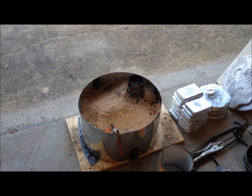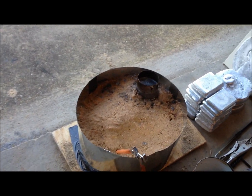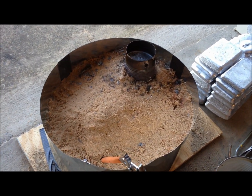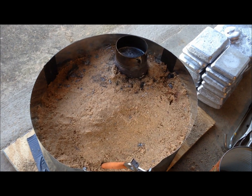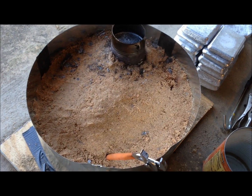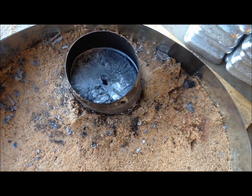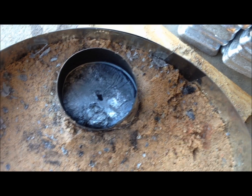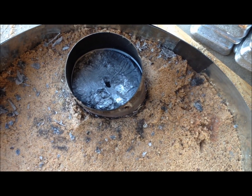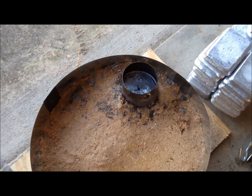Not quite cool enough to pull out yet. Just about done cleaning up and I wanted to show you something. The can over that inlet is dual purpose: first, it helps you aim; second, it provides head pressure so as the metal cools and shrinks, it has something to draw from. I'm a little concerned this might be a short one — not enough aluminum in there. Because it drew enough to make a hole. I've never seen that before. Here's to hoping. Once it cools down a little more, I'll pull it out of there and we'll see what happened.